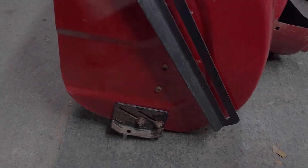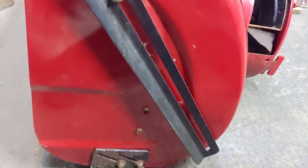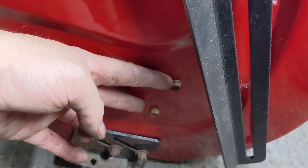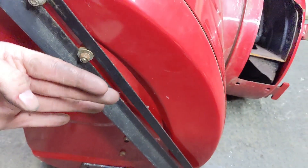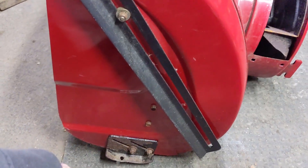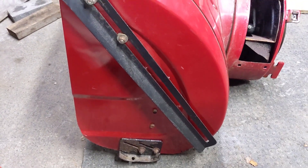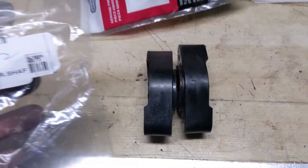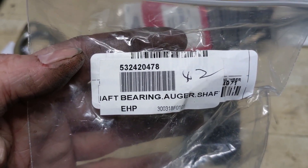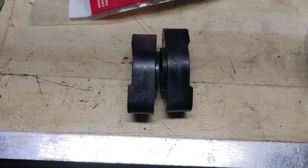There were two things I wanted to mention before wrapping up. First, I did replace the plastic bushings for the auger. When I originally installed them I just snugged these up by hand to allow me to position everything. You always want to be able to pull the impeller shaft back as far as you can. I then tightened them up by hand again because they go into plastic and have coarse threads — you don't want to strip or break the plastic bushings. The part number for the plastic auger shaft bushings is 532-420-478 — they call it a bearing even though they're plastic bushings.